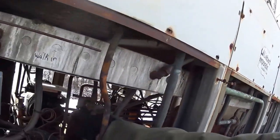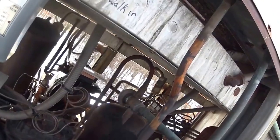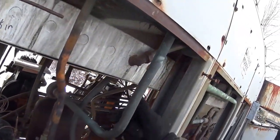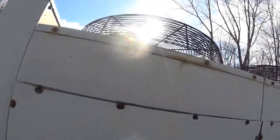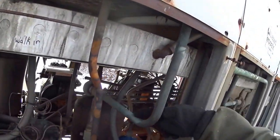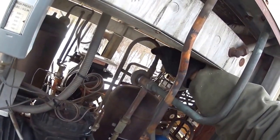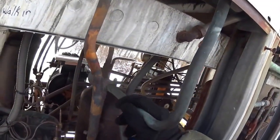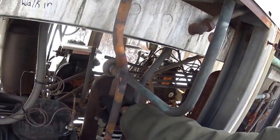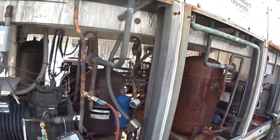This is the headmaster valve, and this is my hot gas discharge line coming off the high side of the compressor. It feeds some of it in here — the liquid coming back from the condenser is up above. The liquid comes back down here, and this headmaster valve, if it's working right, will mix some of the hot gas with the cold liquid, and it should be warm. Now that it's not short cycling, the compressor is not going on and off.